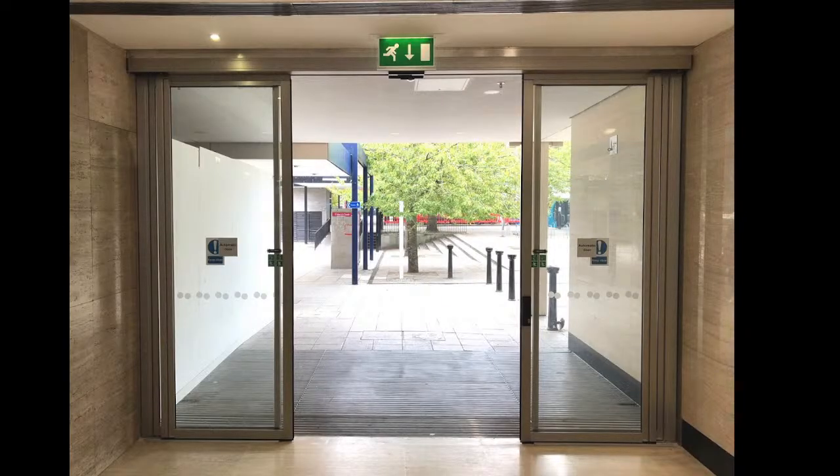But in your case, you don't have to physically use the push buttons for the doors. You just have to use one button which will open or close the motor, sorry, the door. You don't have to physically use the push buttons for the direction of the open door and closed door. You just have to use one push button over here just to detect if there is a person standing in the front, or he left. You just have to make some decision based on that. So when there's a person standing over here, you just have to move the motors backwards, and when the person leaves, you have to move the motor back in.